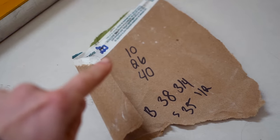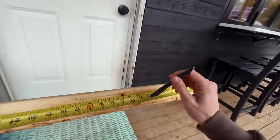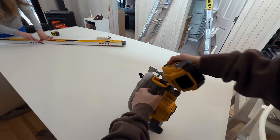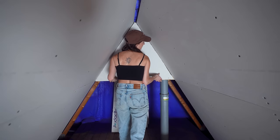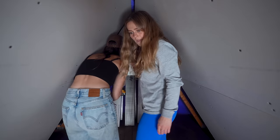Now it's time to finish off the back triangle and we're even going to make a sneaky little secret door. You need three pieces of strapping at 10, 26, and 40. While Crystal's cutting the triangle, I'm going to be cutting the strapping that's going to go on the back triangle. That way we can put our second last sheet of drywall up and it will meet nicely and have something to grab onto. Now I need to do the secret door.